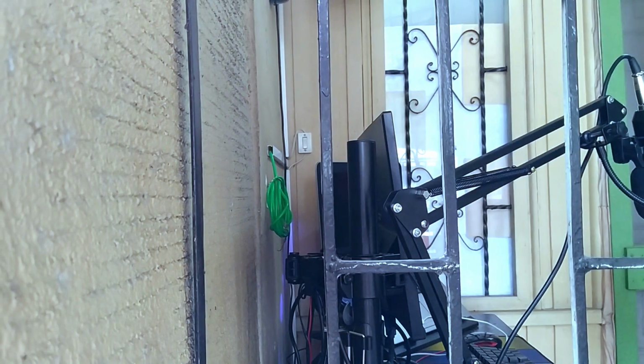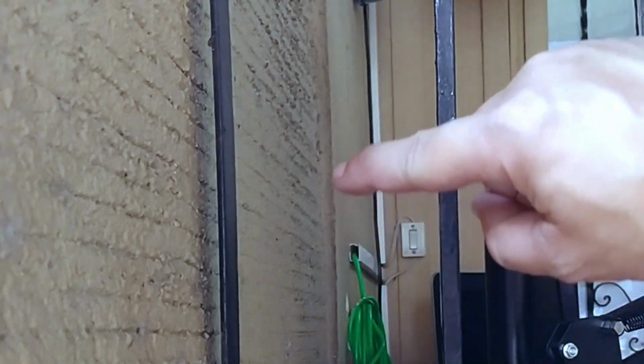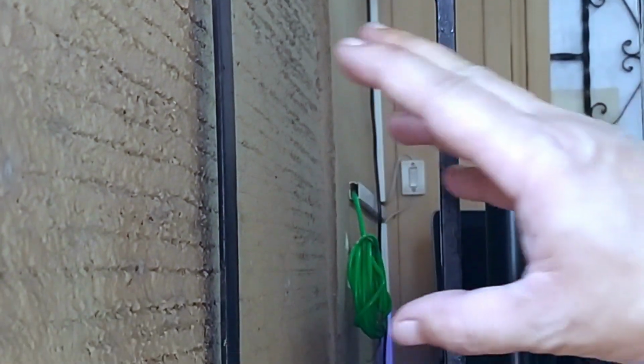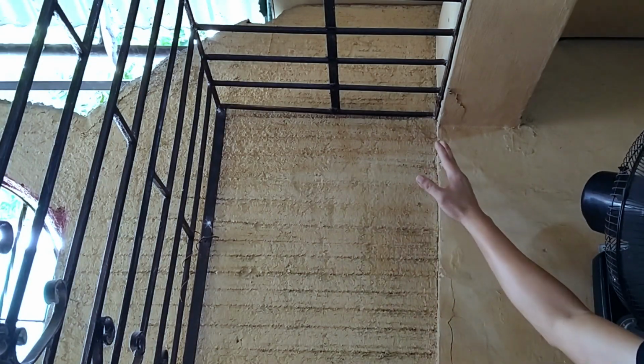And worse, some sections of this left wall are recessed half an inch deeper than the right side, so covering it directly with a foam wallpaper will obviously curve my brick wall pattern, which is not gonna be pretty to look at. So what I intend to do is cover this section with a 1/4 inch thick plywood from the top all the way to the bottom.